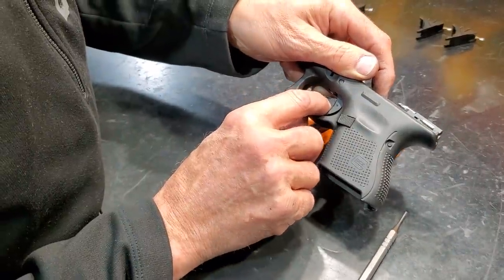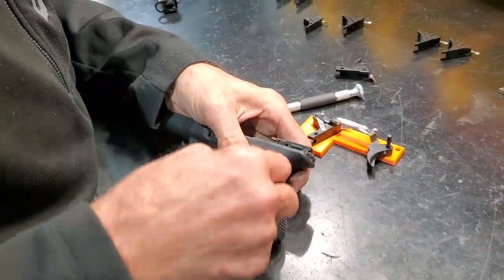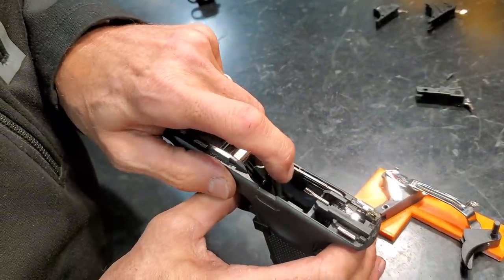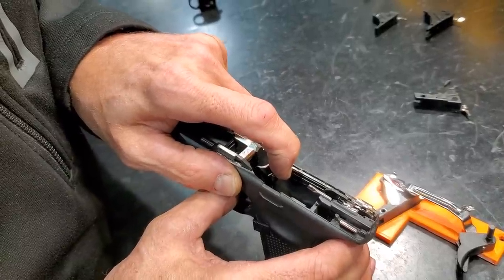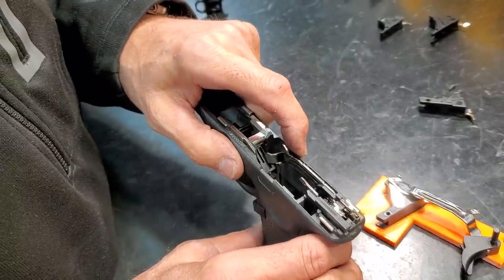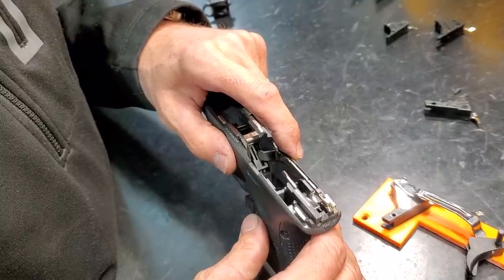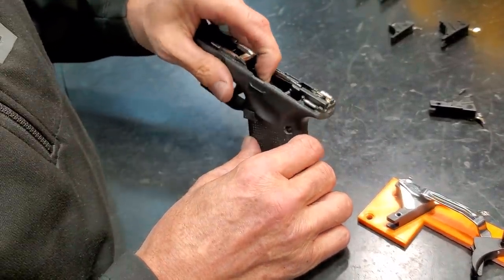Without the stop, it goes further. There is still a stop in here. If this were a trigger I built, it would probably break about right there and you'd have all that extra room which, with this fulcrum, translates to much more travel than you actually want. It's just not efficient, there's no need for it. Plus you'll have a little sight jump - if it's an unnecessary movement, why keep it? Same thing with a lot of the slop in the front.